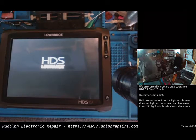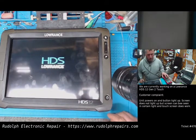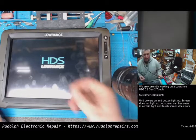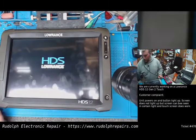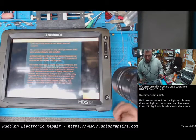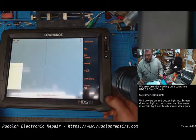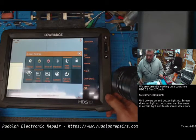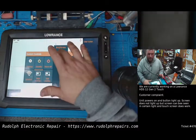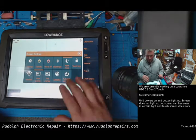So there we go, guys. Custom backlight power supply without using the backlight driver. We didn't have this guy, but we figured out a way of getting this going for the customer anyway. Looks perfect, looks beautiful. Everything works. Excellent. So now, last test. Obviously, if you touch brightness, it's gonna do nothing because we have our own backlight driver. So that's okay, customer's fine with that.